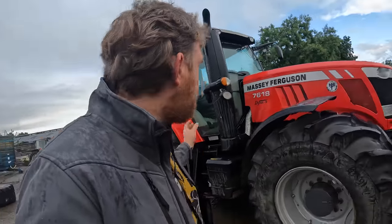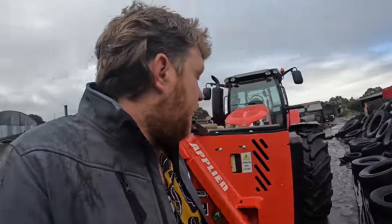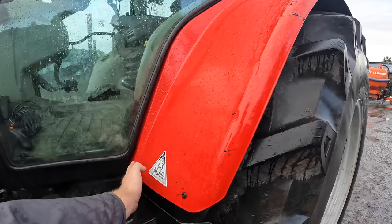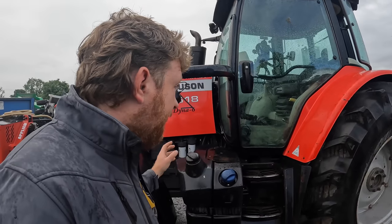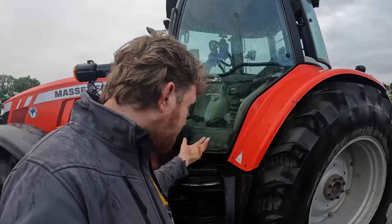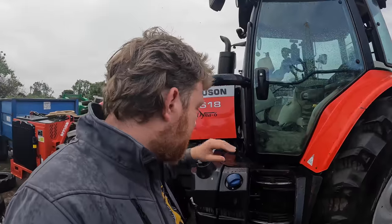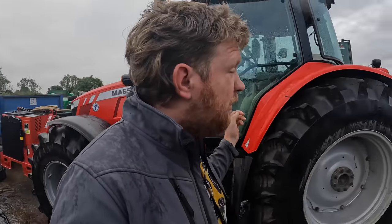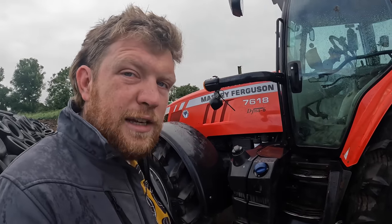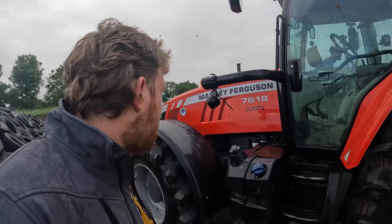Most of the oil comes off the far side, comes down behind where the diesel tank is, so you can't really see it. We actually ended up getting a parlor hose where we were working, just stuck it in over the back end, left it for about half an hour, got sandwich and tea, came back, started up - the leak had stopped because the back end had cooled down and the thermostat had closed. We pumped with it for two days and never lost any oil. We drove back without the trailer because we thought maybe it was the trailer pulling it, got her warmed up, and just as we were coming back into the yard she started leaking again.